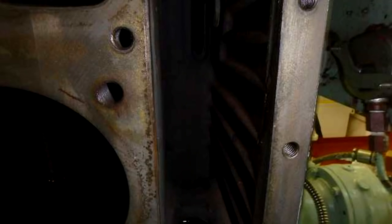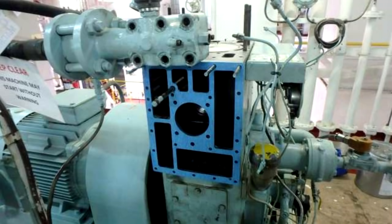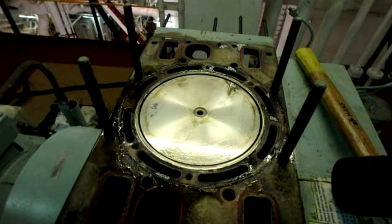The housing was found clean, not so much dirt and deposits inside. The most dirt that we found was on the coil around, and the coil was also inspected, and all the tubes are in proper condition and do not have any damages. As you can see here, we have applied new gaskets, always attached on the surfaces. The surfaces will be cleaned and inspected for any damage.